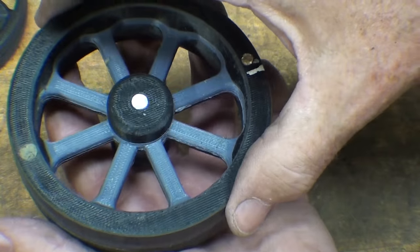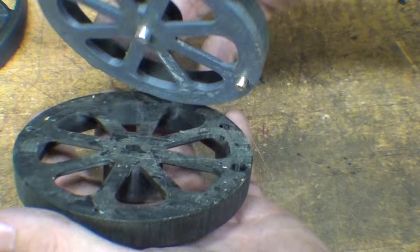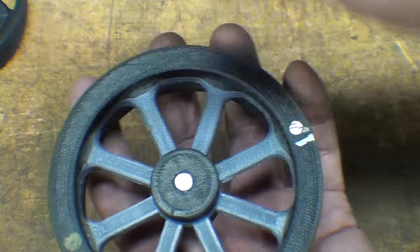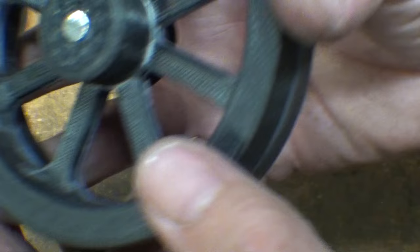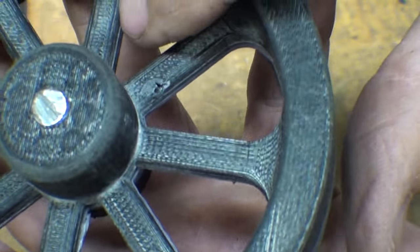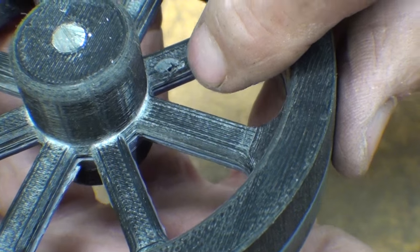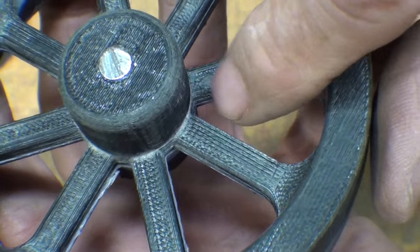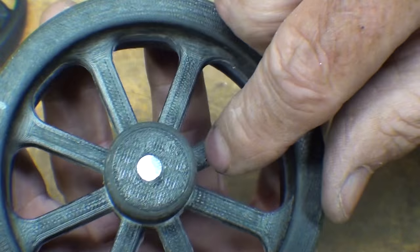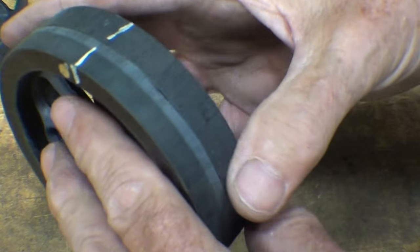Finally done — this one took quite a bit of time. I put a little brass alignment pin right there. I got some extra holes, but they won't hurt anything. I did have to fill one hole where I misdrilled — just put some clay in there, it's not too critical. But examining this, there's a flaw right there on one of the spokes that is a void. Maybe I'll put a little clay in there; I should fill it with body putty but I'm not in the mood.